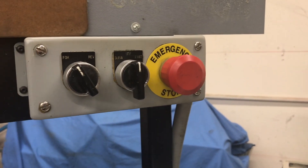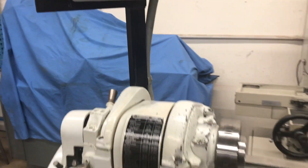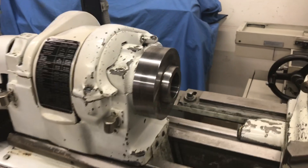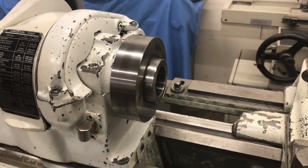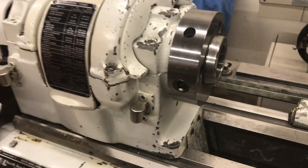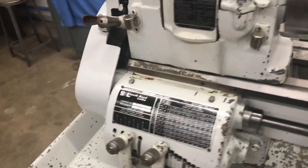There's the headstock, and this is a later model unit with the controls up here. This is a two-speed three-phase motor — forward, reverse, fast and slow. Will stop — now running in slow. Runs very smooth, very nice. Instantaneous reverse for threading — just engage the gears here. It has a very quiet gear train.